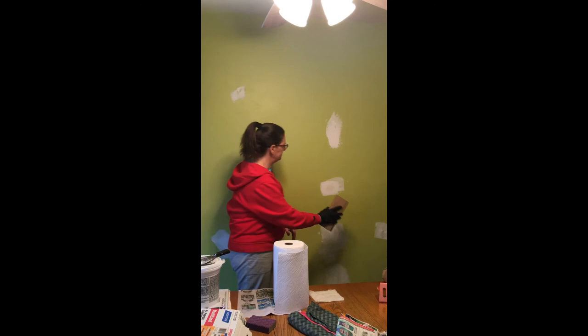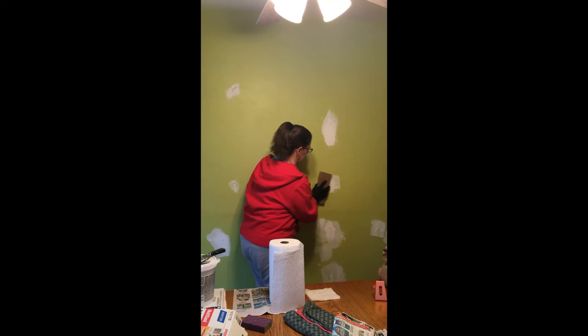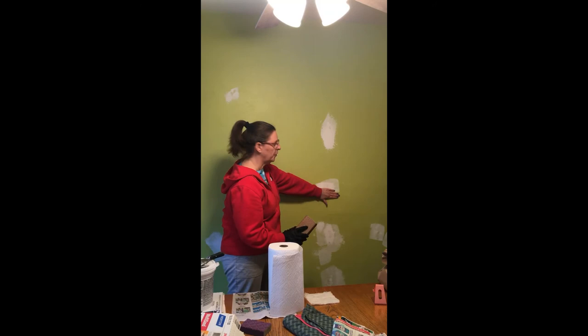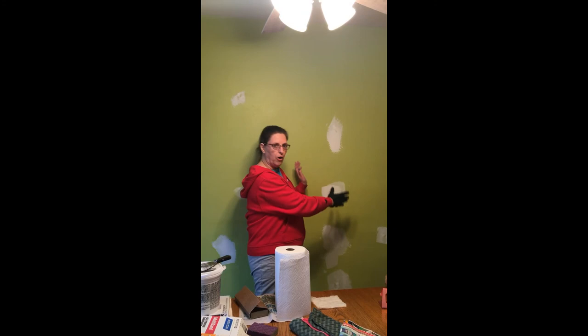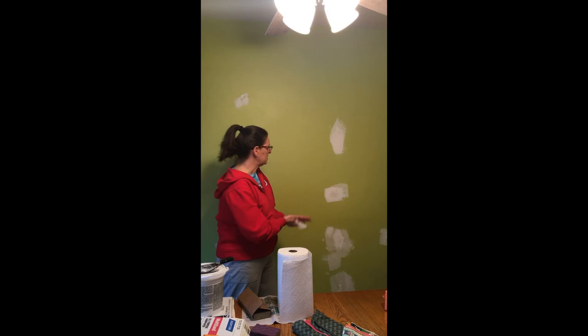You're just going to give it a light touch and then test again with your bare hands. This feels smooth to me. If I felt any depression I would try again with the putty knife and spackling glue, but it feels perfectly flush so I'm going to say this spot is done. After doing this with all of the protruding nails and any depressions, I'll go back over the wall with a damp paper towel and lightly remove any dust. Once you've done this with the entire wall, you're ready to paint. Have a great day.